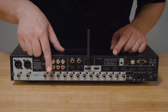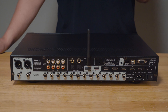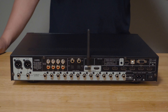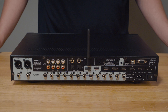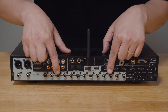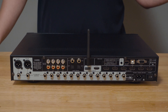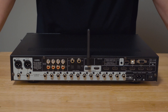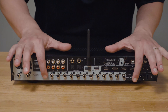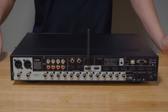If you only have two height channels — whether reflective or ceiling type — the information is prioritized in decoding as middle height speakers. Middle height designation means those two speakers capture all of the height or Atmos information. In that case, use the LMH and RMH (left middle height and right middle height) outputs on the back of the processor. In this unit you cannot assign the other height outputs to be active if only using two height channels. In the X series like the XMC2 and reference RMC-level processors, you have more assignability. If you have four height or Atmos speakers instead of two, use the rear and front height outputs — rear for your two rear heights and front for your two front heights.